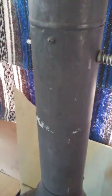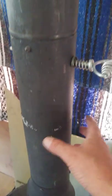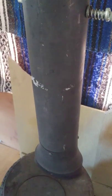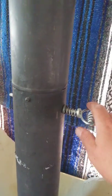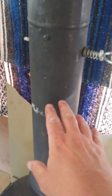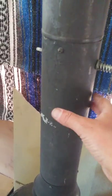Moving on up — the stove pipe. It's four and a half inch, I think. I had to buy this off the internet; I can't remember where I ordered it from, it's been a number of years. Without this damper, it's hard to control the rate of your fire, and there are going to be times where you want it. This will also make the pipe radiate a lot more heat, because you've got about a foot to a foot and a half of pipe full of hot gas and burning smoke. So instead of having that shooting right outside, you want to slow it down and have it radiate more heat.